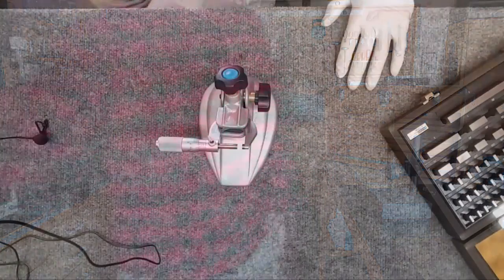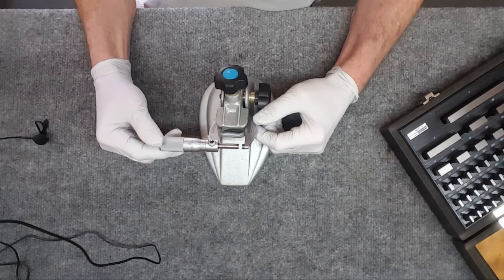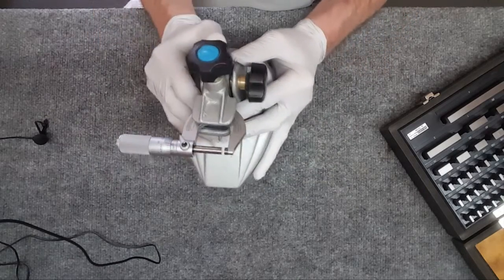Now let me show you how to correctly read a micrometer. I'm looking at the specification of the non-digital type — the one that you just rotate — and it's good to a tenth of a thousandth. It dawned on me that there's a vernier on it. Measuring to a tenth of a thousandth is pretty easy with this mic — this is the Mitutoyo 101-117. These numbers here are the actual thousandths.